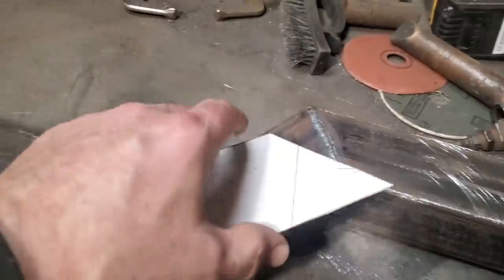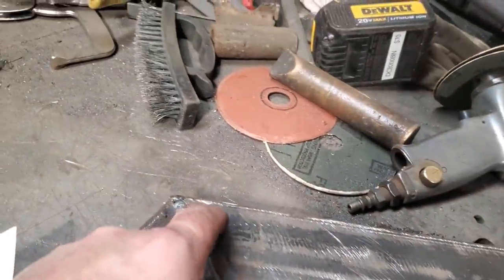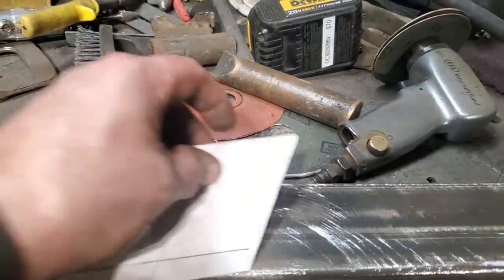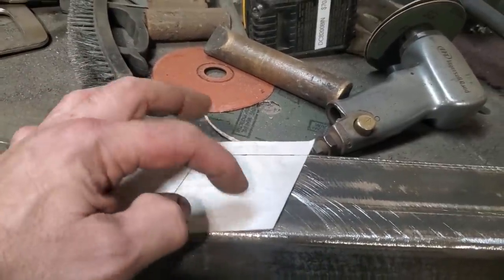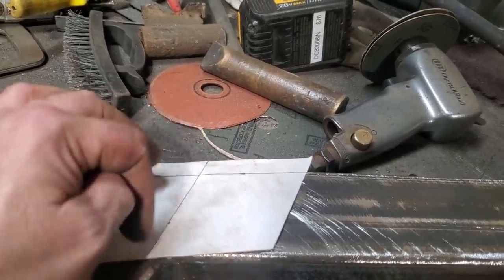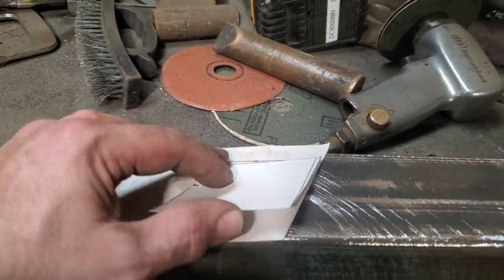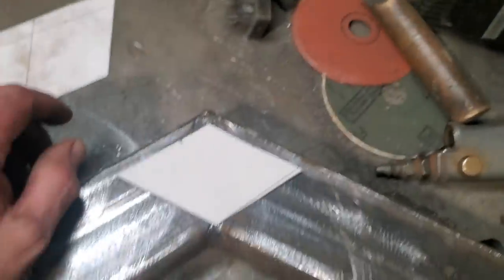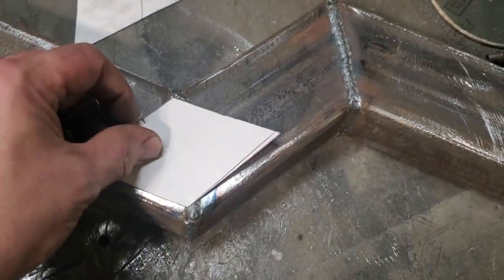And how I'll go about doing that is, you remember these templates that I had here? That was the one that I had made for there. I figured I'd like to have it about a quarter of an inch off the edges here. So a quarter of an inch is a half inch, so this is 2.5. All I did was measure up 2.5 inches parallel to this one and marked the line. I marked over this way here, 2.5 inches, marked the line and then drew it off. Then instead of cutting that one up, I just made this little diamond from that there. Then when this mounts, like so, and is welded on, it will have a nice little pattern to it, right? So I'm going to go ahead now and cut four of these out, because I'm going to put one there, and then two on the other rail.